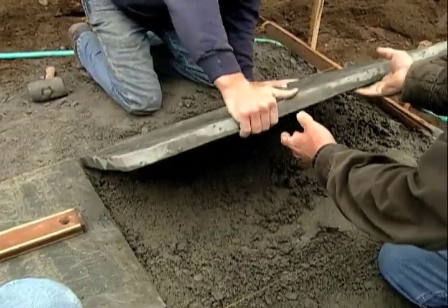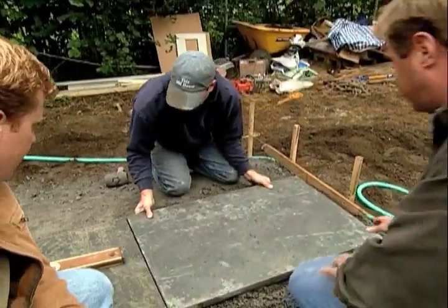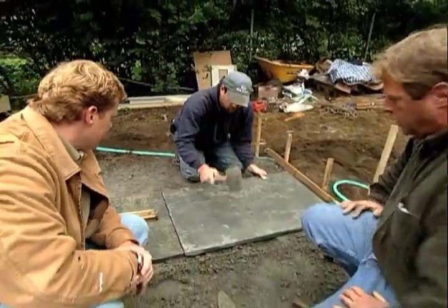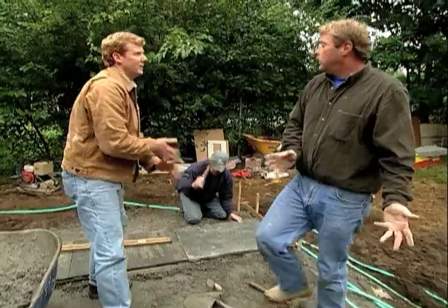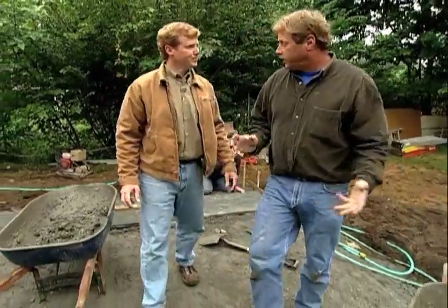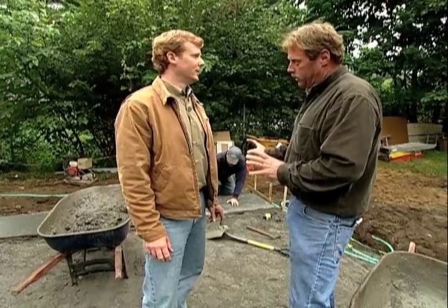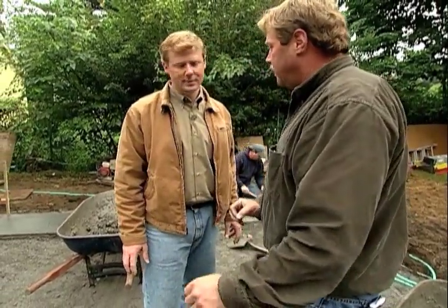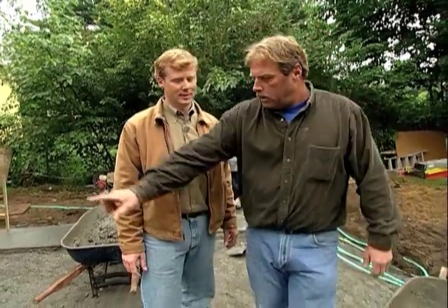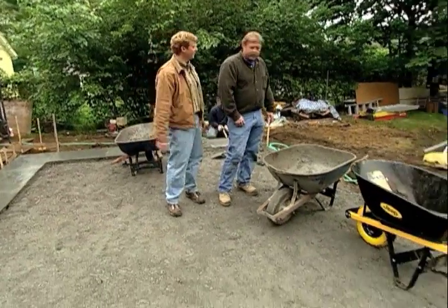You've got some Portland cement in there, so that's going to give it some nice rigidity — just make the stone stiff and stay right in place where we want it. Tom taps that down, solid as a rock. Now don't get me wrong, we're not laying down a concrete base. That's just a mix to stiffen up and hold that stone in place. In the wintertime it'll flex a little bit, but because we have all this pack in here, it's going to drain — there'll be no water there to cause it to heave. And also we have pitch coming across the patio, so the water will run off.